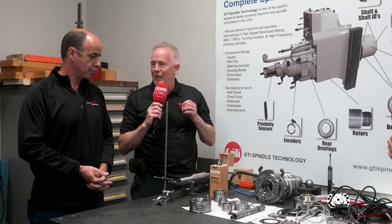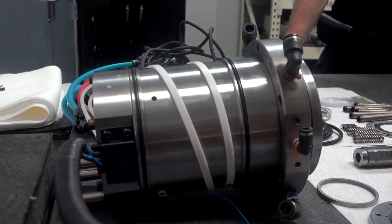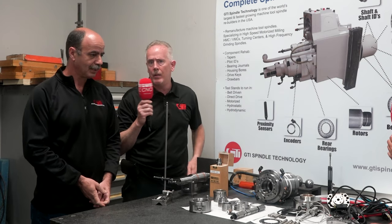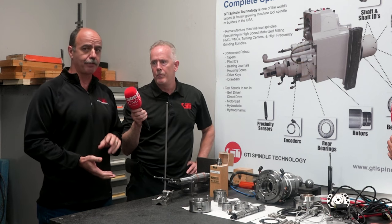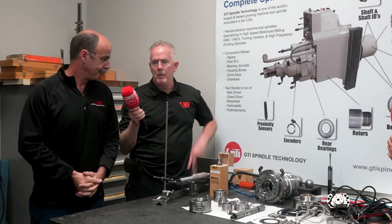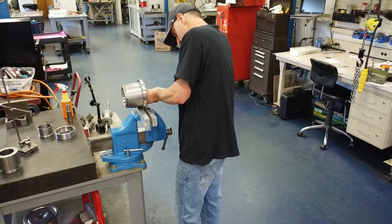There are a lot of tribal tricks to all those things that we're talking about, and that's something we want to emphasize here at GTI. This is a Makino V22 — it has a special lubrication system. Every spindle brand is special and has their own niches, but this particular one has a lubrication system that actually recirculates and refrigerates itself. What they're trying to achieve is that the whole machine stays at the same temperature — they run the lubrication through the shaft, through the bearings, and also through the lead screws and machine base, so as it warms up the machine grows as a whole, and it just makes a better, more precise product at the end of the day.